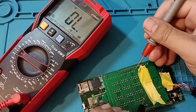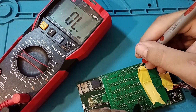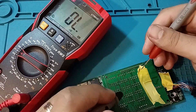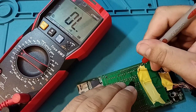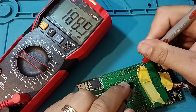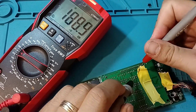Pin 1 and 2 — this is pin 1 and this is pin 2, or opposite, it doesn't matter. It will show you all the time. If it's good it will be around 190 ohms. If it's bad it will be lower. You should have around 190 ohms. We have 188.9, then 189 ohms — it is very close. This is the first measurement.